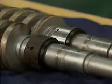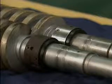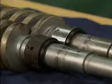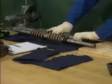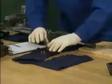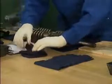The last components to be removed in this example are the inboard mechanical seals. As with the outboard mechanical seals, each seal is marked as to its location, and its position on the shaft is determined by measuring. After marking and measuring the inboard mechanical seals, the mechanic carefully removes each seal and wraps it in a clean cloth to protect it and keep it clean.